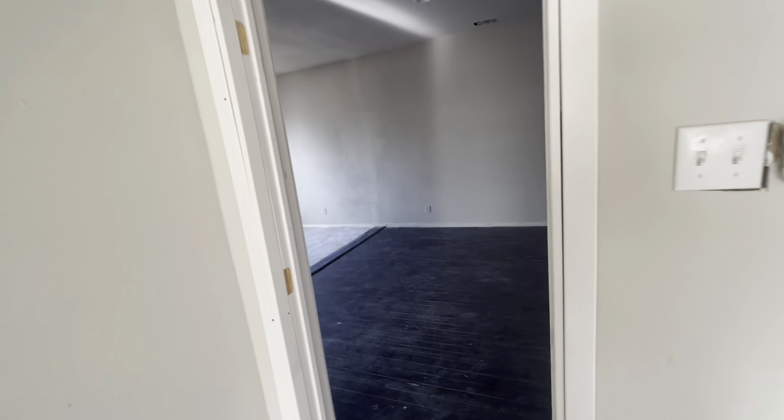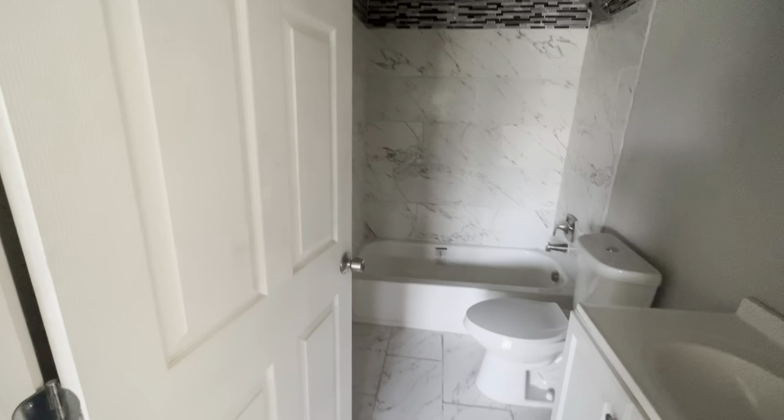The whole door frame needs to be fixed and finished. Moving into the bathroom — this door needs to be adjusted so that it closes right and has the right daylight. We simply need a switch plate cover, and we need light fixtures. We need a light there, a cover for the exhaust fan, and the light fixed above the shower. The shower needs to be re-grouted up through the top and the grout cleaned up on both sides. There's also a hole in the sheetrock around the toilet.